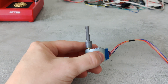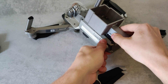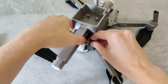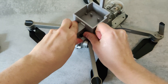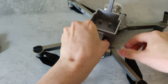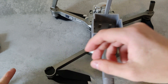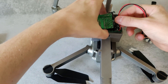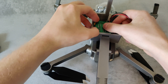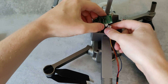It is such a tight fit that I don't need any glue for this part. The main structure is attached to the built-in mounting pins on the drone. The little box in the front is made to hold the 9-volt battery and the electronics. The two longer extrusions are used as a separator for the battery and are a tight fit, as they need to hold the battery in place. Most of the weight from all the parts will be at the rear of the drone, so I chose to have the battery as far forward as possible to balance the weight more evenly. Each corner under the perfboard has four extrusions to lift it up and prevent rubbing against the plastic. The driver board is turned upside down to take up less space. I made a small hole for the motor cables to go through the back.